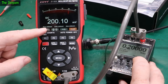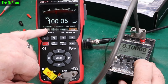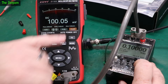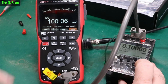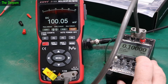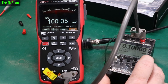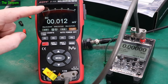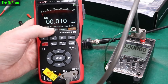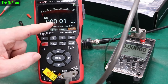The meter also has maximum, average, and minimum display. As I step down it shows max was 200 millivolts, the average scaling down over time, and minimum 100 millivolts — a nice little feature. Average is quite good too if you've got something periodic. One thing I'd like is if it actually stated which range you're on, rather than just the digits changing — it would be nice if it said 25 millivolt range or 250 millivolt range explicitly.